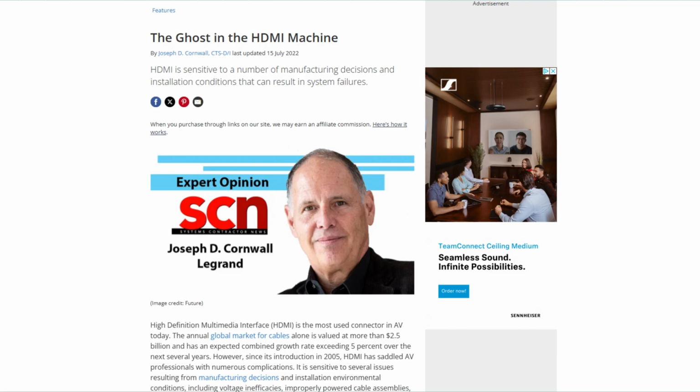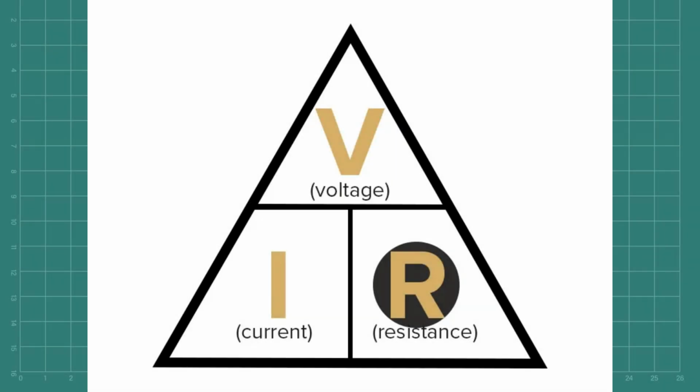a problem. You see, voltage drop is not going to cause an increase in current, which will blow the 630mA fuse. In fact, it's quite the opposite. It's a fundamental principle of basic electronics. A voltage drop causes a current drop because they're directly proportional to each other, according to Ohm's law, which states that current, I, is equal to voltage, V, divided by resistance, R, meaning when voltage decreases, the current flowing through the circuit also decreases, assuming that the resistance remains constant. So again, I think we must discount this theory.